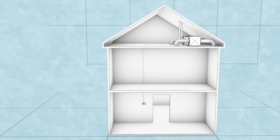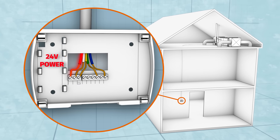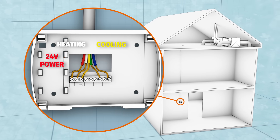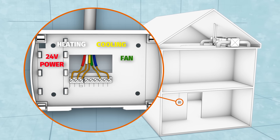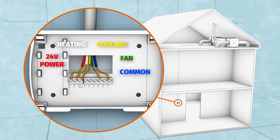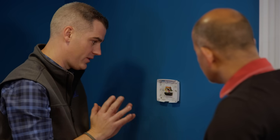What I expect to see for a heating and cooling thermostat is a five-wire setup: red for 24-volt power, white for heating, yellow for cooling, green for fan, and blue as the common wire. So let's take a look behind the scenes. I can see right away that we have two different R connections — an RC and an R — so that usually means dual transformer, meaning a separate transformer for the thermostat downstairs running the heat, and a separate control for the air conditioning upstairs.